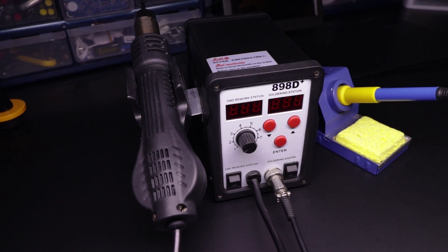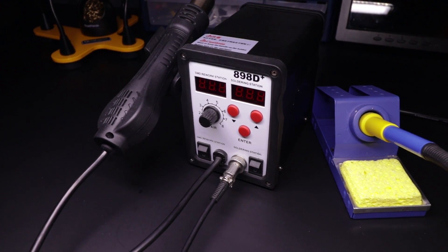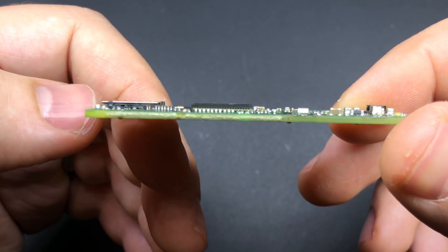So with all that said, this is the soldering station that I've been using for the last year and a half or so. I've been really happy with it, and I know a few other people on the forums have been using it as well. It has the two features I mentioned, and the tips are actually compatible with Hakko brand tips. It also has a hot air rework gun attached to it, which I didn't think I'd use very much — but I use this thing all the time. It's especially handy for stripping down Raspberry Pis, like removing the USB port, HDMI port, and things like that to make it smaller so it can fit inside projects more easily. You can get it for between fifty and sixty dollars, so not bad at all — you get a lot of bang for your buck.